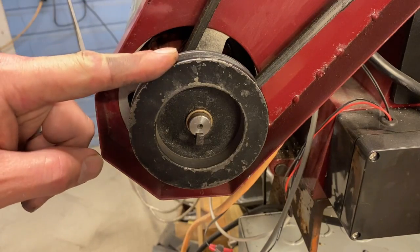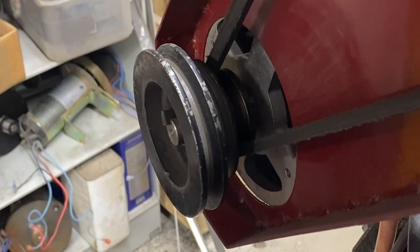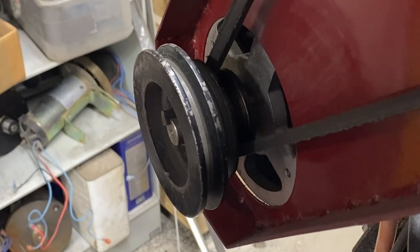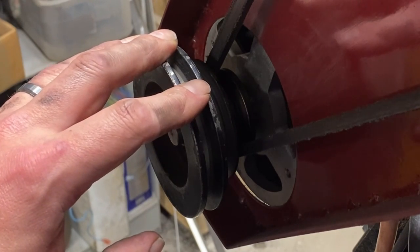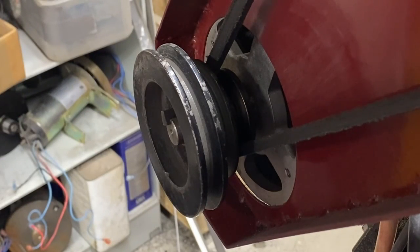This is the conical pulley that came on my AC motor — it's got three different sizes: small, medium, and large. That was originally how speed was adjusted on this lathe. I'll admit I was a little lazy: I put it on the smallest drive pulley on the motor and the largest on the spindle, which brought me in at 500 RPMs, and basically ran the lathe at that one size. That's not a good way to do it — especially within a single operation, because as diameter shrinks while turning, your need to increase speed grows. That's why a variable speed system, where you can adjust with the turn of a knob, is far superior and results in far better cuts.